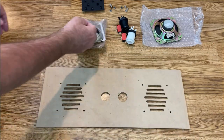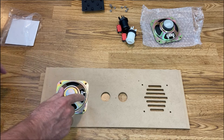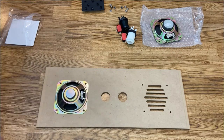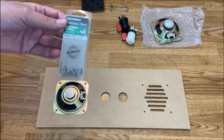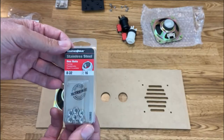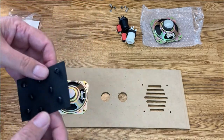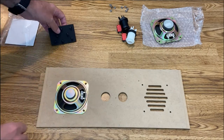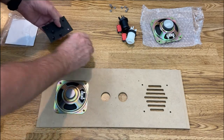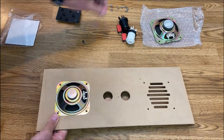Flip it over. We're going to use our 4-inch 8-ohm speaker. The best bet is to have these lugs pointing inside — it'll help when you put the wiring harness in. The bolts we're going to use are half-inch 8-32, from Lowe's for about $2.40 a box of 12, with associated 8-32 stainless steel nuts. I spray painted these with matte black to camouflage them when you see the other side.